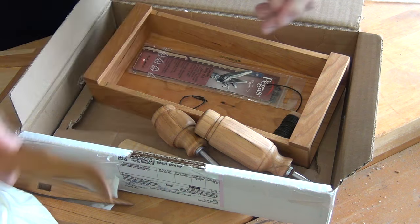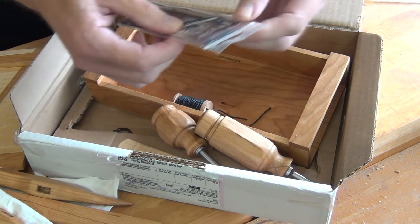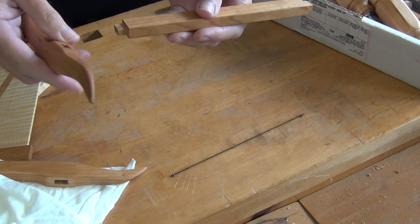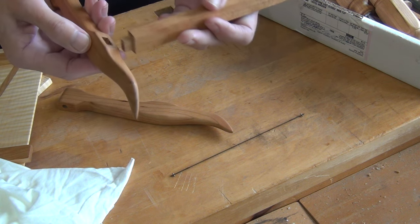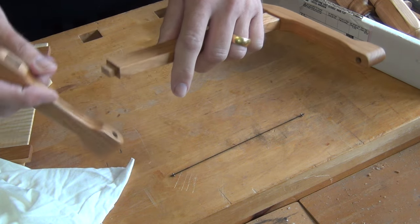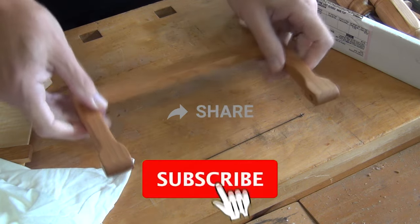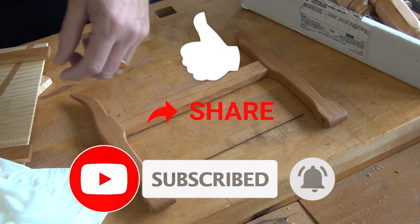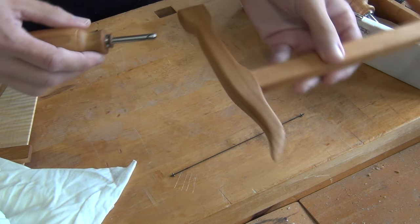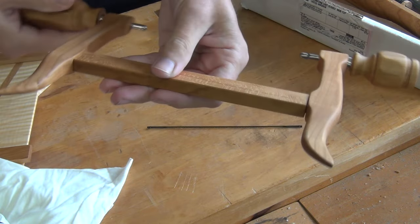One of the frame sides - lovely! We've got some thread for tensioning the saw up, and some blades in the bottom of the box as well. That's a coping skip tooth blade - that's going to be excellent for clearing out the waste in dovetails. Gorgeous. There's a marking on here so we get them the right way around. These things don't get glued together - they're allowed to move as you tension them, taking up tension on the blade.